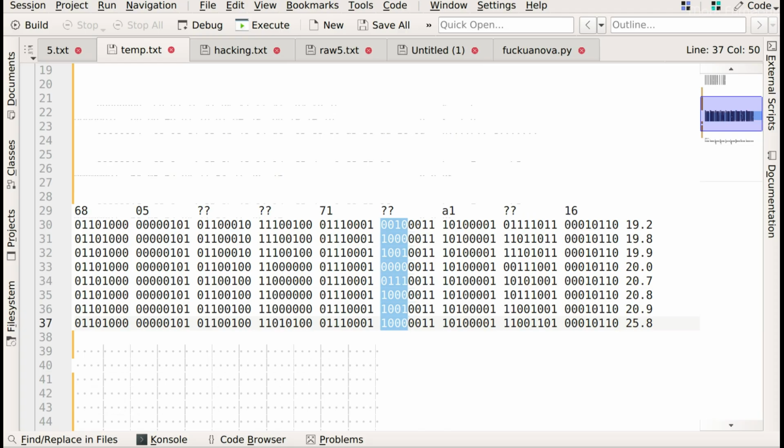And obfuscation normally takes place by doing some sort of nibble swapping, byte swapping, reversal. That's another one. XOR was another thing that you see a lot, where you XOR the whole thing with some value. That works well because it's really easy. You think about this. This is being done by an embedded processor, which means they're going to be using very, very computationally cheap operations to get the maximum obscurity out of the data, right? So there isn't going to be any crazy math here. It's going to be binary things, bit shifts, XORs. Those kinds of things. That's kind of what I expect to see here. Swapping, I've seen instances where they take nibbles and they have some sort of translation table that maps them to different places, but usually just moving data around. There's no big crazy math involved.